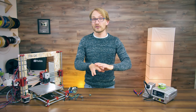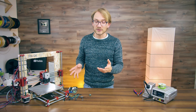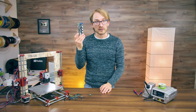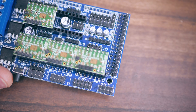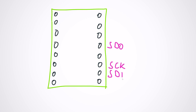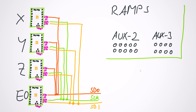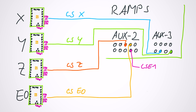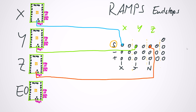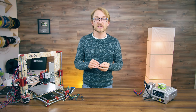Okay, let's do that. Figuring out exactly which pins on your motherboard to connect to is a bit involved, so I'm not going to go into full detail here, but on the RAMPS and on many other boards that have evolved from the RAMPS, the pinout is identical. What we'll need to use is the AUX2 and AUX3 connector - and yes, if you're using an LCD, one of these is already going to be used up, but you can also configure it to use other pins. I'm going to show you how in another video. Connect the shared bus signals and the individual chip select and diagnostic pins like this. Okay, that's the last time you're going to need to touch the hardware. The potentiometer on these is not going to be used - from here on out, everything's going to be software.